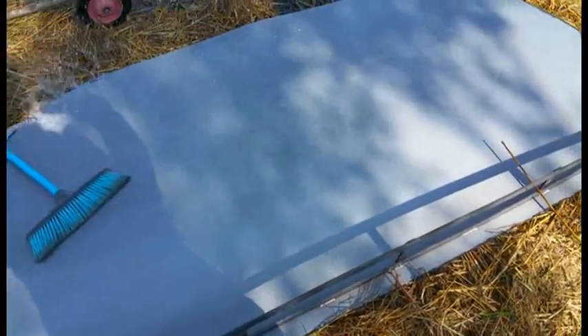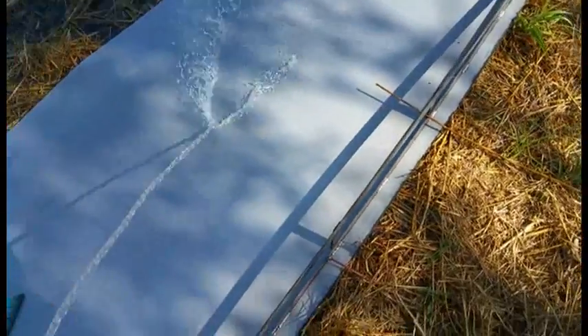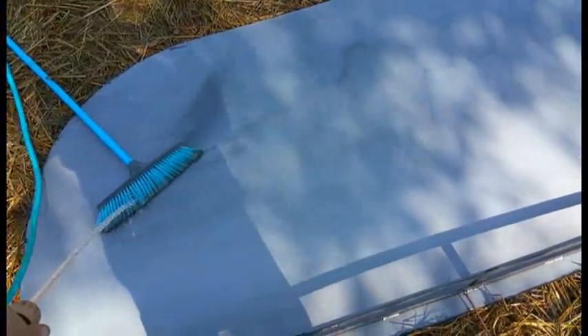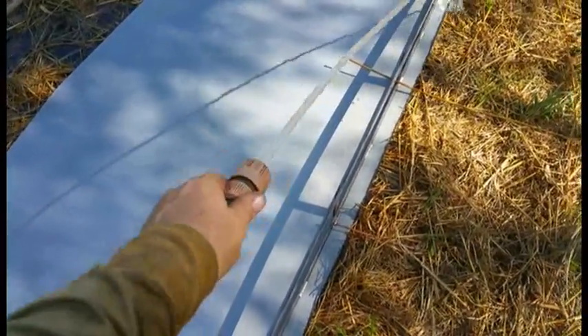Because this plate has been chemically cleaned, as soon as the water evaporates it will rust immediately — you'll get a brown film on the surface. But that's not a problem at all. Once the plate dries, I'll take it up to the workshop and just buff it over with a grinder and a stripping disc — a light polishing or sanding disc — and that will remove any of the light rust that forms on the surface, and then I can just spray paint straight over it.